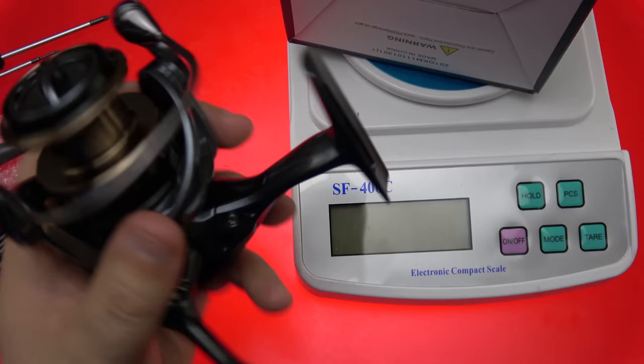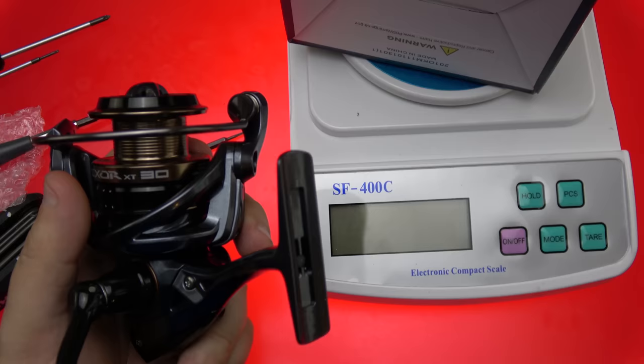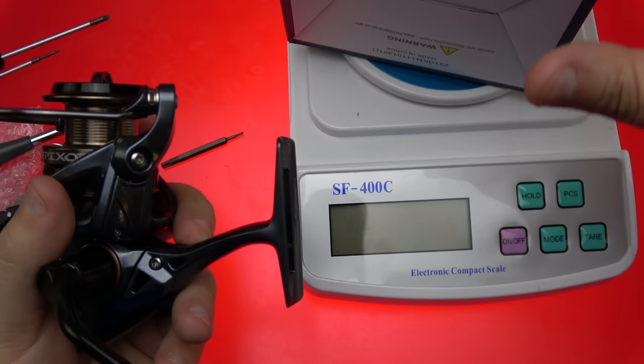It's going to take over all metal reels. I can guarantee you that. And I'm also, at least in my impression, when you had reels that were fiberglass or glass-reinforced composite, that glass reinforcement chews up the molds in which they squirt the stuff in there and cast the parts from. I think these long-strand carbon composites do better in the molds, so they can get more life out of the mold, which is very expensive when you have to actually make a new mold.